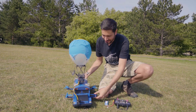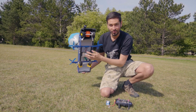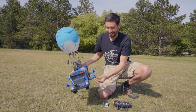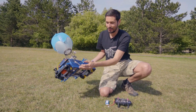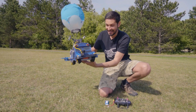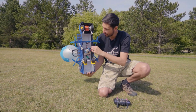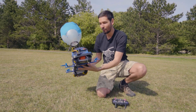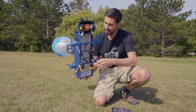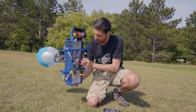As you can see in the building process, I'm using this custom-made drone built for this bus — a wooden frame with all the electronics that make a drone fly. I'm using four-blade propellers, and everything is blue: the motors, the propellers, everything matches this design. It works like a normal drone using a 4S battery. The only challenge was dealing with the extra weight, so I had to modify the PID settings to make it behave better.